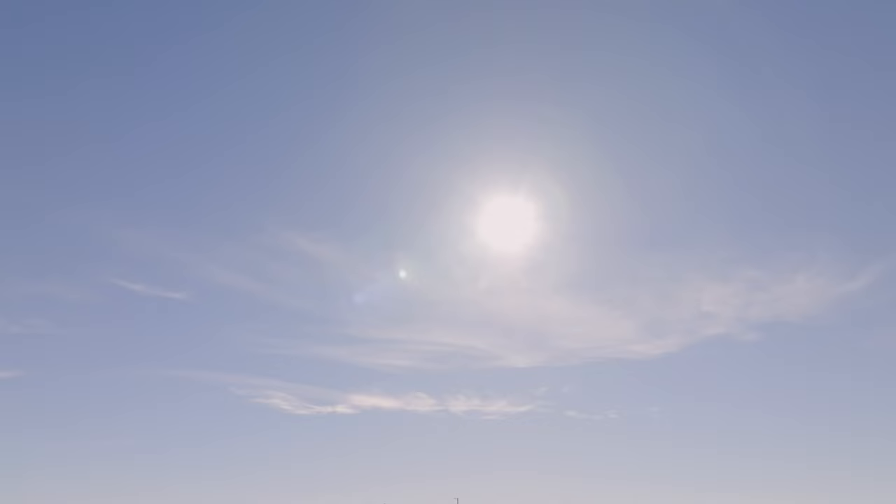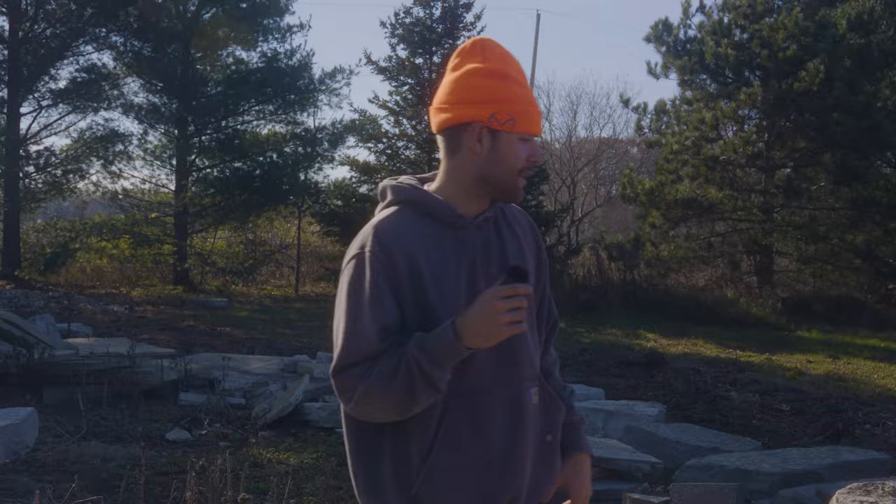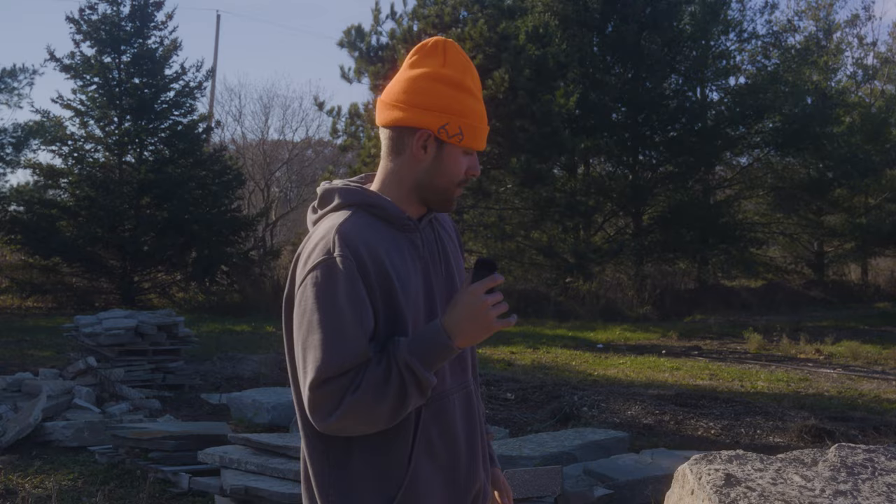This rock right here — we went out late last week and hand-picked it from one of our stone suppliers. We're going to core drill through it — a 24-inch core all the way through. It's going to be a gas fire feature with a gas insert and a key to turn the flames on. We really liked this rock — it's pretty dimensional, which is exactly what we were looking for. When doing the core, we want to make sure we have at least six inches on either side of the drill path.